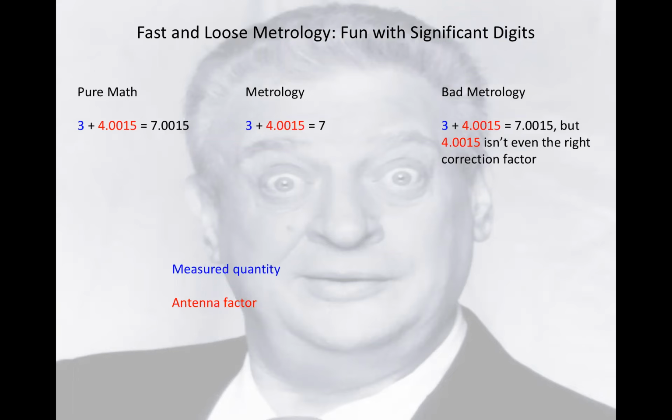The big driver for this, and some people might laugh, but it's aesthetics. In a lot of cases, the dictates from the styling people are that they want no visible antennas. And that is why you don't see whips on the fenders. That's why you see stuff that's in the back glass or in the shark fin or hidden in liftgate spoilers and all that kind of stuff. But I can tell you those antennas have nowhere near the gain performance of that whip on the fender. Not even close.